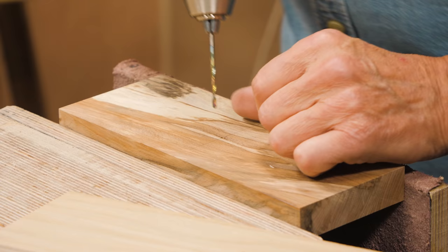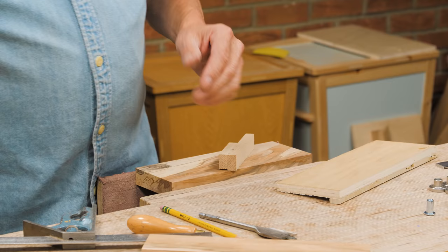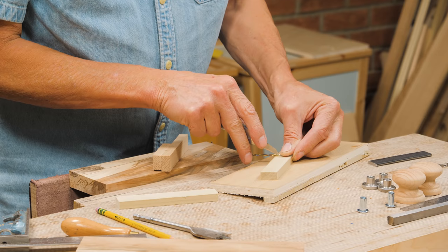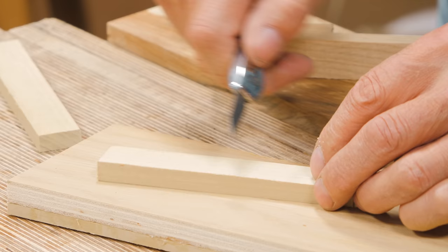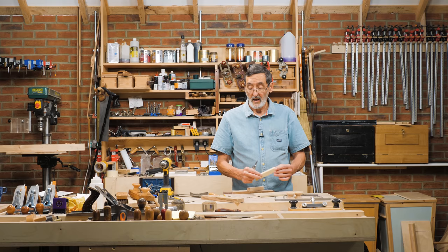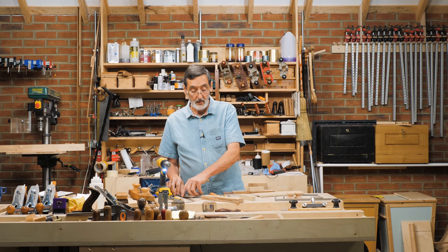I put a channel in the piece of wood, took my drill bit, placed it off center, took a knife and marked both sides of it, got the depth, cut across the grain from both sides with a 1/8 chisel, then took some super glue and glued the two halves together. I ran my bit through it and it kept it perpendicular and dead square — that was the important part. We want to be dead square with this pilot hole, and we'll be using this bit at different points throughout this project.